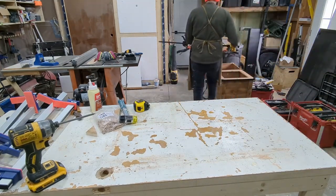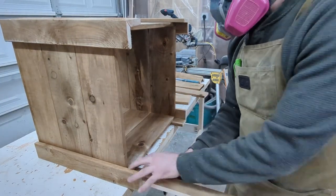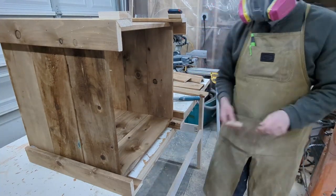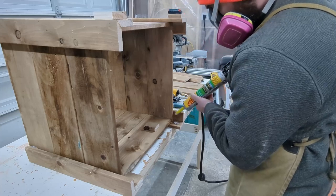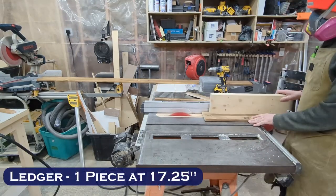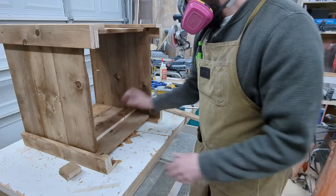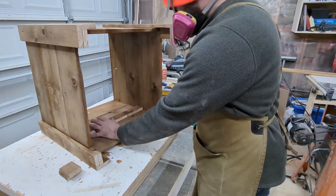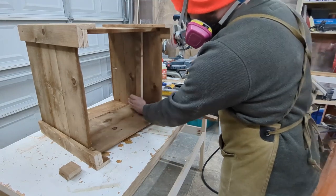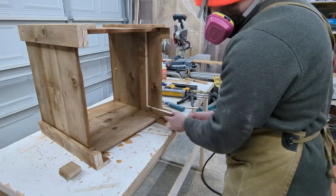Here comes a part of the build that's probably not really necessary — you could just take your ledger boards that your bottom panel is going to sit on, nail and glue them into your side panels and call it a day. But because I like to do things a little overkill, first I'm making some spacers out of scrap blocks to fill in a couple inches between the ground and the side panels. A dab of glue and a couple nails gets the job done. Now I'm ripping down a few boards to use as our ledgers — these are what are actually going to hold our floor panels inside the planter. I typically place these about 10 inches down from the top because you don't need that much dirt in a little garden planter. Once you've determined the elevation of the ledger, take a scrap piece of wood and cut it so it fits between the ledger and the ground. This way any weight on the floor of your planter is directly sitting on top of your ledger, which is directly sitting on top of these little posts, which is directly sitting on the ground.